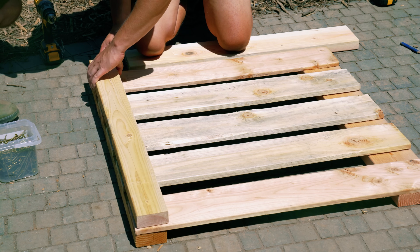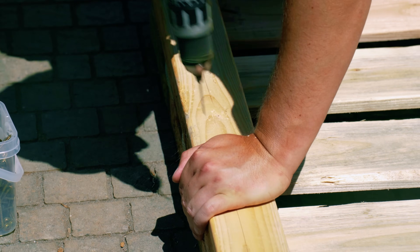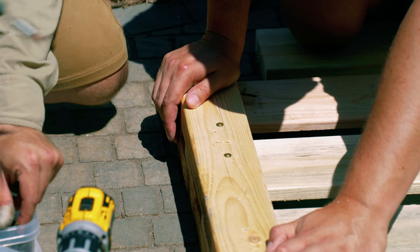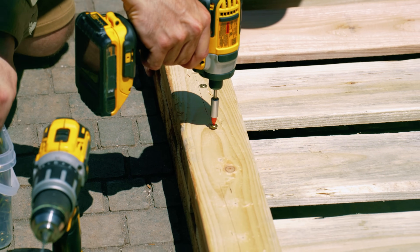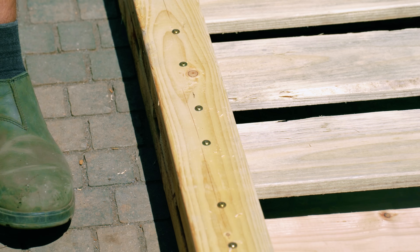We'll explain why that side is two by six later. We're just going to put two screws into each plank and that's going to create a very rigid, tight structure with a lot of airflow. We're using low-profile cabinet screws that are quite long and thin — we don't want to split the wood, but they also help pull the wood together since we're doing this sandwich move.